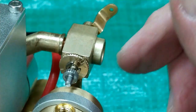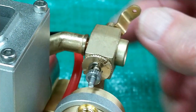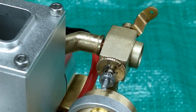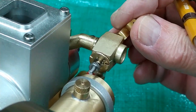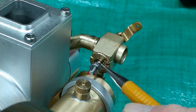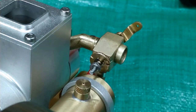With it all back together, the barrel is not terribly round — it itself kind of clunks back and forth — but by lapping those two pieces together I can now move the barrel back and forth while the disc remains stationary. I have it back at about the same position as when I received it, so we'll fuel this up and see how it runs. An OS, Enya, Saito, or Weber carburetor this is not — the barrel is not fully machined, it's very sloppy. There's air leakage past the barrel and probably right where the needle valve goes in. It has the right idea but not the machining, and it's not going to have the fine control that some have experienced on model airplane engines.